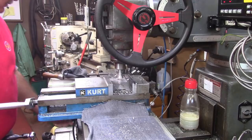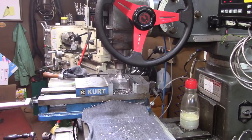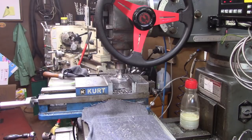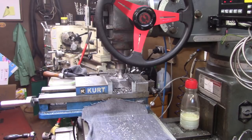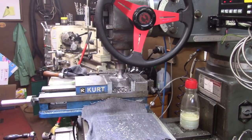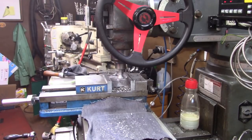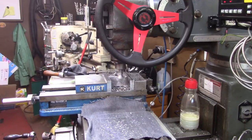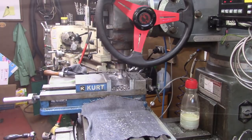So normally when I'm doing this, I'm doing about 30 thousandths of feed, and I'm running around 500 RPM, well within the speed for high speed steel. I just kind of do this for feel. And the deeper you get up into the insert, the more you're cutting off. So I kind of hold it to about 30 thousandths a pass, so I'm not abusing anything. That's a lot of beating that goes on in there, and your stuff can move. So going in there taking big passes really makes it hard on everything.